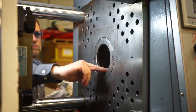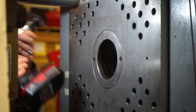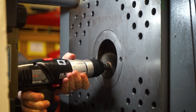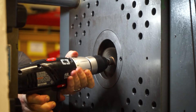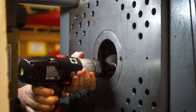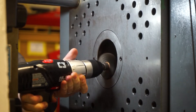Let's check the locating ring for any buildup or high spots in there, which happens a lot of the time when people force the locating ring in. I'm going to use a wire brush in a drill and get all the extra stuff off of there. If the metal is actually a little bit deformed, this might clean it up a bit. All this does is help the locating ring slide in there easily so you don't get it stuck or force it in during a mold change.